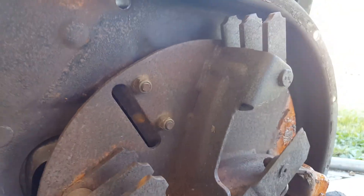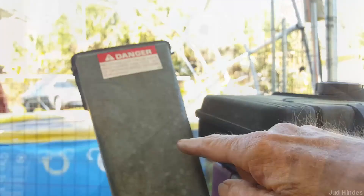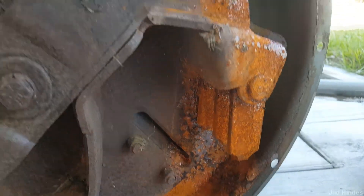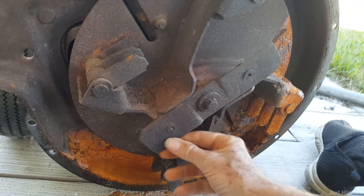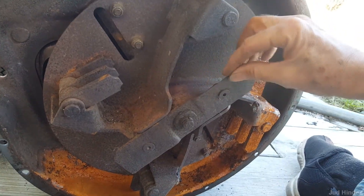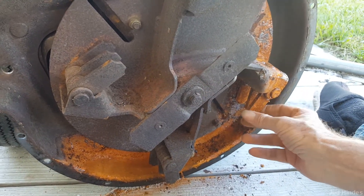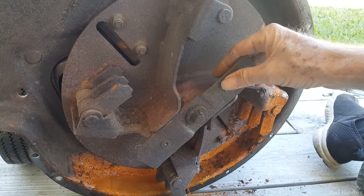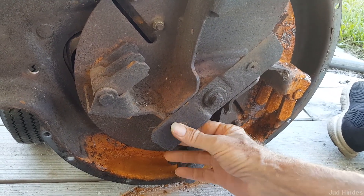This is interesting. You can see there is an intake blade here and here for that chute — that's for feeding limbs, and those have a pretty good edge on them. And then on this side, that's for the big chute, which is the side that keeps kicking out. This is a blade, and it has got an edge on it, but it's a little dull. We're going to sharpen that up, and we're going to oil the hell out of these, which have got to be breakers — there's no real edge anywhere. So these are just breakers, and this is where your cutting is happening. Maybe just sharpening that up will help. I'm not sure if we want to take that off or not — I'm just sharpening it in place.